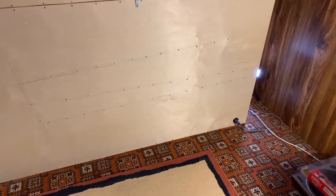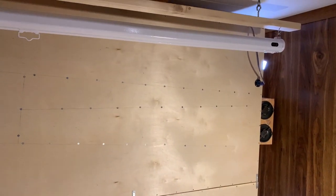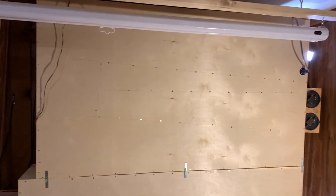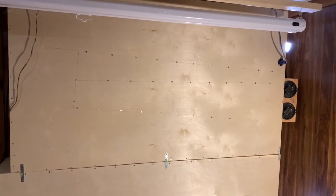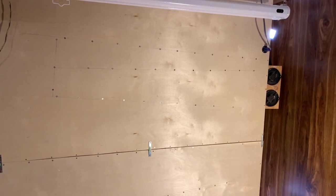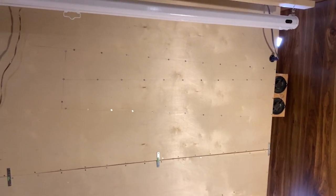So that's basically what we've got going on here. We've got two gigantic tapped horns, and these are 16 hertz tapped horns. So I've taken about a 70 foot wavelength and reduced it down to about 16 feet or so of horn.